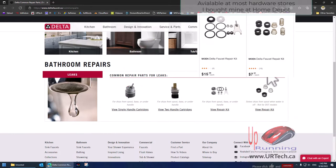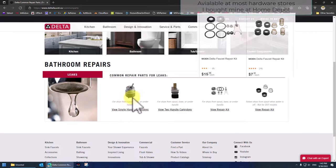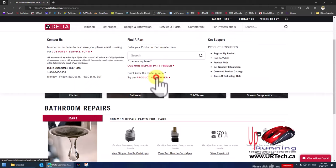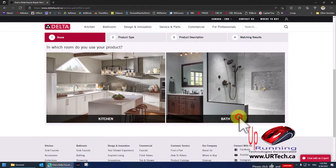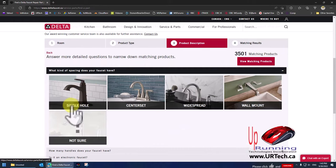This is all we're going to need — this little repair kit. We bought this one to show you what it comes with. Some people will have these single-throw handle cartridges, but that doesn't answer the question of which model you have. Go back to Service and Parts and go to Try Our Product Finder and just drill through. Bathroom, sink faucet. This is confusing for people: single hole or center set. Single hole means there's one hole through the surface of the sink. In my case it's a center set even though I have a single throw — I actually have two lines coming up.